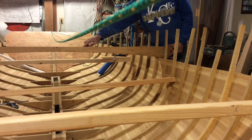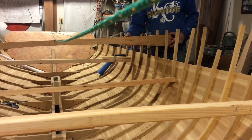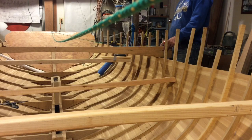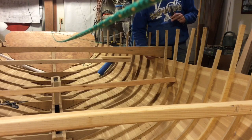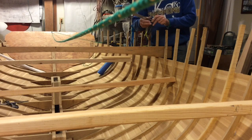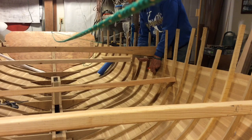I've got a little line marked in the middle of this deck beam mold. I put that up there on the line that designates where the center line is, hold this down here. Now I'm on frame 14 and I want to find out what the bevel is of the frame to the deck mold. I got my little bevel tool, put it on the frame and then bring it up and adjust it to where it's flush with this deck beam mold, just like that.